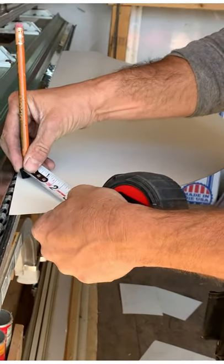And then I'll cut this one as well. As I was saying — short strokes, shorter strokes — the less it's going to curl that metal. We want to try to curl that metal as little as possible. The more you curl it, the more we have to straighten it up when we lay it down. I'll just kind of gently twist on it and counter the curls to get it to naturally lay flat.